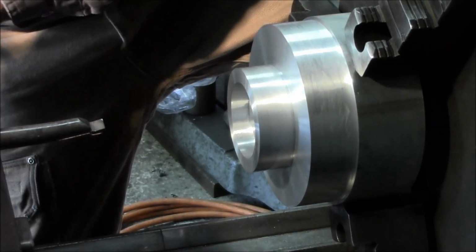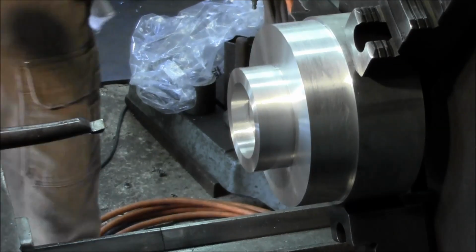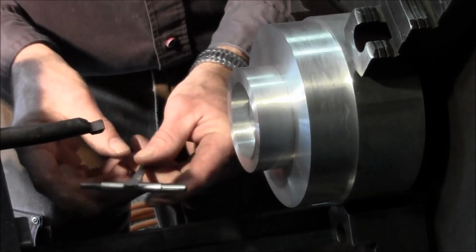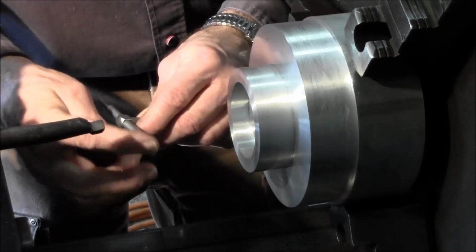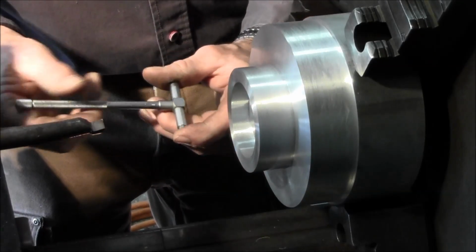All right, now I'm going to show you. Let me see, is it? Yes, the larger ones here. You notice that there's a large diameter and a small diameter in here, and they spring inside, they telescope inside. There's a spring in there, there's a groove, and this little plunger right here goes in and tightens on the side, and that's how this thing works.